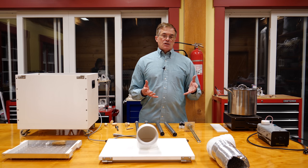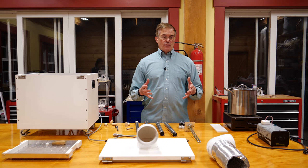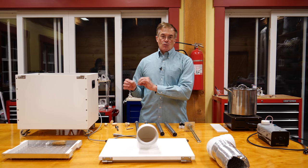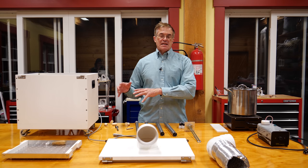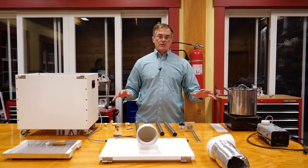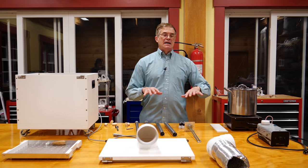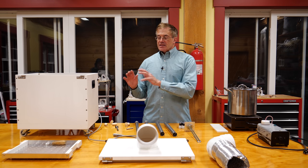Even though the liquid is heavier than air, the vapor coming out is pretty hot so it tends to be neutrally buoyant. Consequently, it fills a room relatively homogeneously — the vapor will fill the room with no sort of layering effect, which is good for a laser show. But if you want to control the fog and get more of a stratified appearance, a CO2 fogger is great because the fog tends to be heavy and hugs the ground.